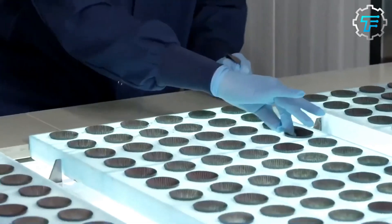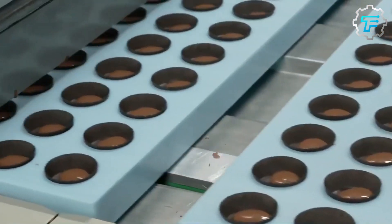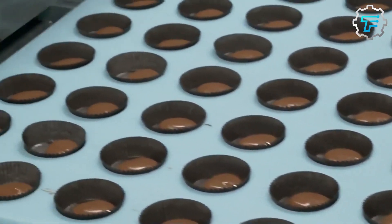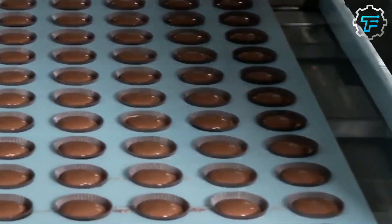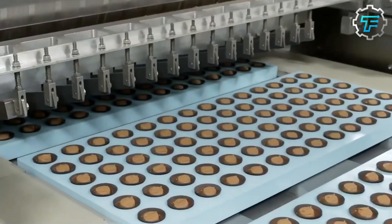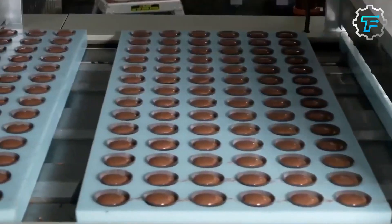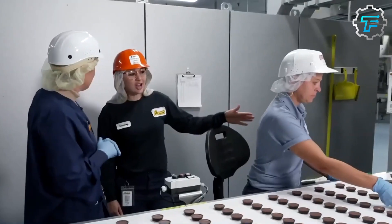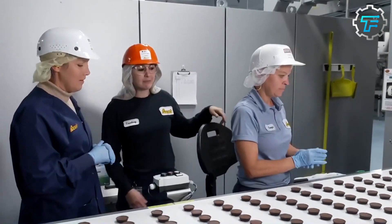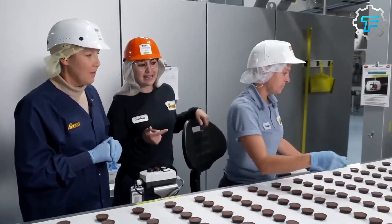After this step, it's time to assemble all the ingredients that have been prepared. First, the conveyor passes the cups through a machine which deposits specific portions of chocolate into them as they go. The chocolate fillings are then left to cool and harden before the cups move on to the next stage, where another machine adds the peanut butter filling on top of the chocolate layer. Finally, a third layer of chocolate is added on top of the peanut butter.